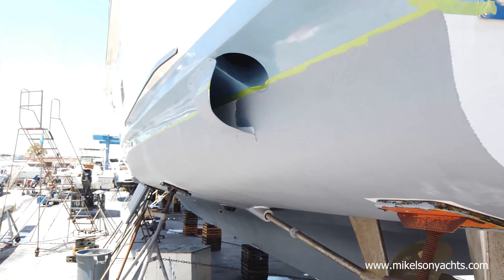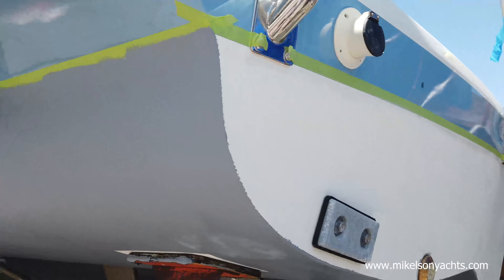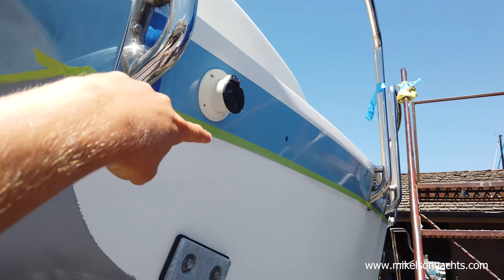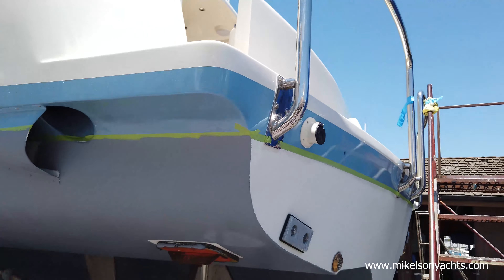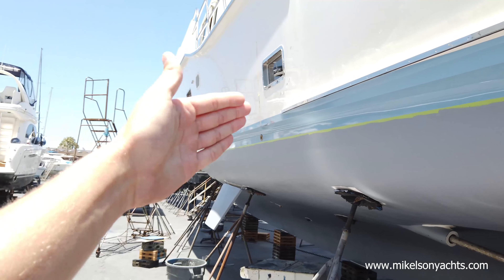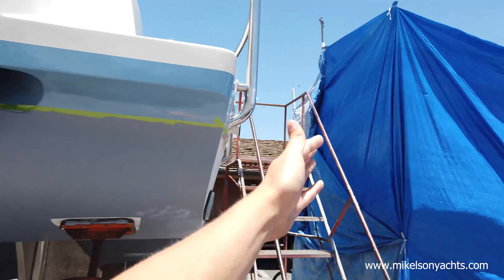Let's talk about the exhaust really quick. This boat has at-water exhaust — it's a little bit above the waterline, as you can see. This green tape is the waterline. You're going to see a lot of boats that put their exhaust right at the back, and that creates a station wagon effect — all the fumes get recycled and go into your cockpit. That's why maybe you've gotten on a boat and smell diesel or gas. We put ours on the side because as air travels down the side of the boat, it's going to grab that exhaust and blow it back instead of recycling it up into your cockpit.